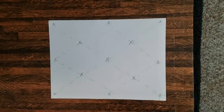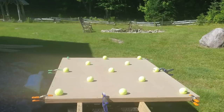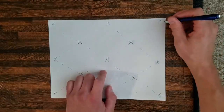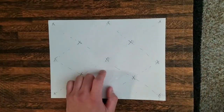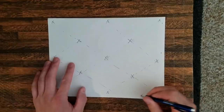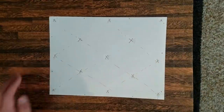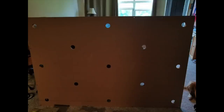You don't really have to do a whole lot of measurements this way, and if you had clamped your MDF boards together already, you don't have to worry about doing this twice — everything should be in line. Now using your two-inch hole saw drill bit, you're going to drill out each one of the marked spots on your MDF board. After you've done that through both layers of MDF board, take the five-eighths-inch or half-inch drill bit, depending on the size of your zip ties, and drill holes around the perimeter to keep the boards together. There's no real science to this. Do all the drilling through both layers. I recommend doing this outside as the MDF board is very dense — when you're drilling it's going to create a lot of smoke and heat because of the composition of the MDF board.